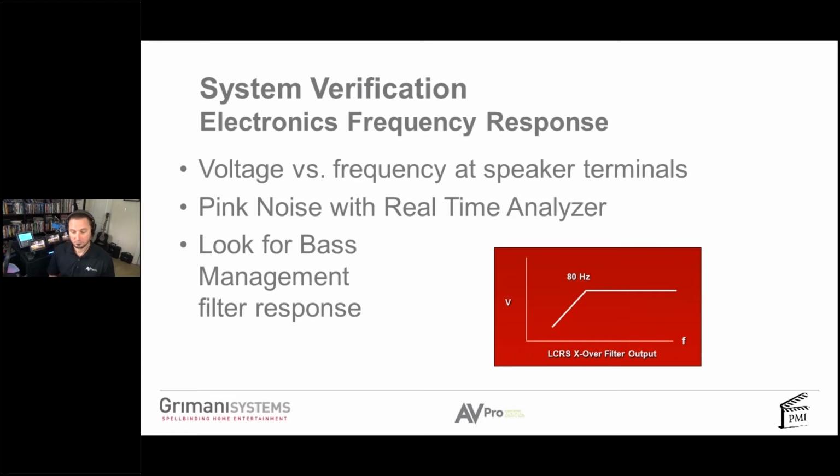Turns out that the wire inside the walls was cut by the electrician by mistake, and they spliced it. But when they spliced it, they didn't really know how long they had to make it. So they left a big piece of wire spooled up in the back. So it's like, yeah, whatever, it's all fine. And so instead of having 25 feet between the amplifier and the speaker, there was actually 250 feet of speaker wire. That'll do it. And so, first of all, shame on you for cutting this wire by mistake and not telling the integrator, because that's bullshit. And then shame on you for leaving all of that wire coiled up there because you just didn't know what was going on. And then it would have been shame on me for not having found it.